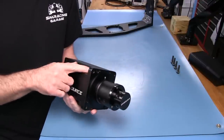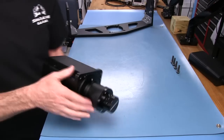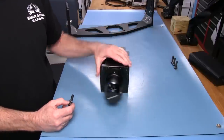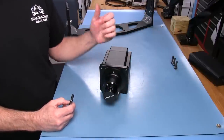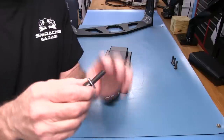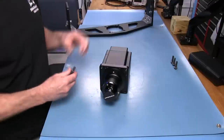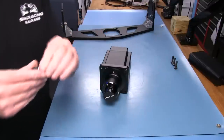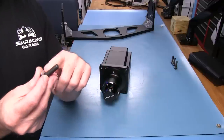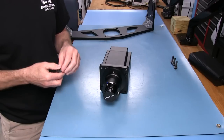Now, that's 27 millimeters of reach I need on my bolt. And a little bit hanging out of the back is not going to make a difference, right? So I have these guys, and these are mine. The bolts that don't come with this as far as just the motor. Now, if you get their option of motor mount, it does have some bolts for it. But, yeah, these are 30 millimeters long. Socket head cap units, very strong. We'll get the job done. Just put a washer on there. Because we're putting it in slots in this front plate, I like to have a washer on there just to make sure I get good grip on that slot because it's not real tight around this bolt here. It's close enough, but not real tight, which is good because you do need some wiggle room sometimes to match the holes up.